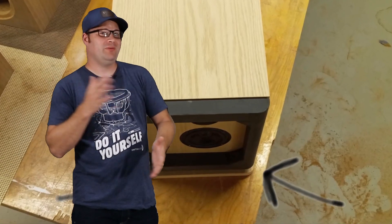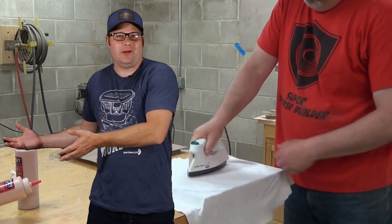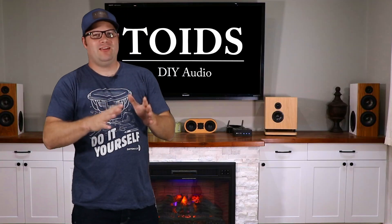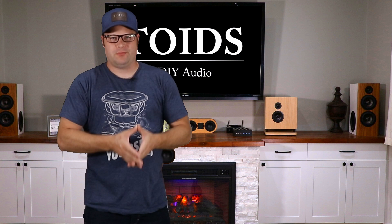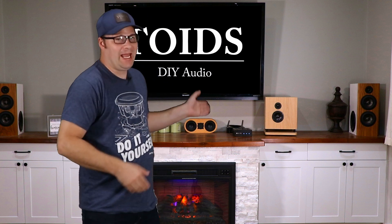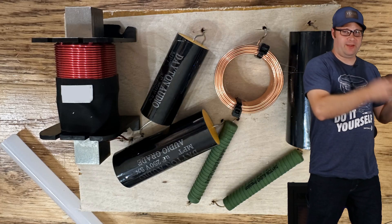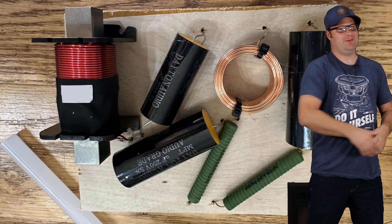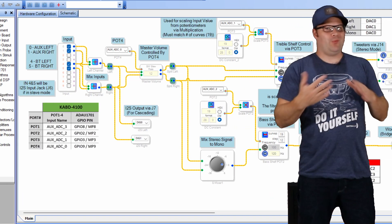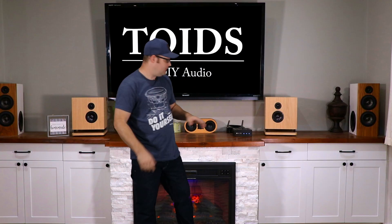This video is going to be a little bit different because of that. Usually you're going to be watching me do an entire speaker build, but not this time. Instead, this video is going to focus on the heart of the speaker — the crossover and the DSP — because this is actually a hybrid system. A hybrid system basically means you're going to do part passive physical crossover and part DSP. Now why would we want that on this particular build? Let me explain.